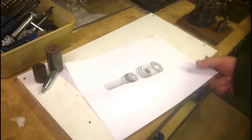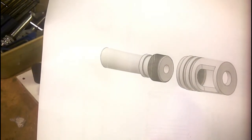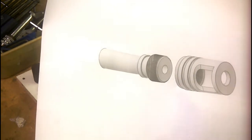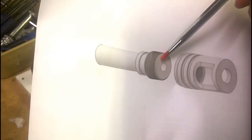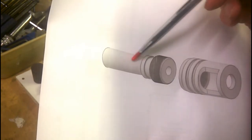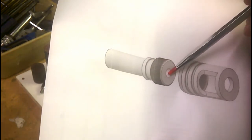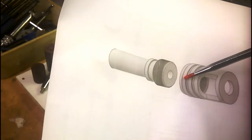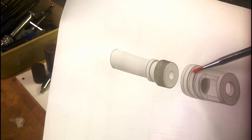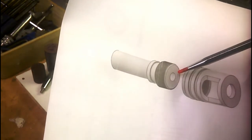Okay, so what do we mean by a lantern chuck? It's a specialised piece of tool holding, specifically in this case for holding bolts for shortening. It consists of two main parts, the shank, which this portion fits in the lathe chuck up against this stop. There's a threaded portion here with a central hole. This hole has a protruding rod, and the screw-on portion of the chuck here with these reliefs screws on to